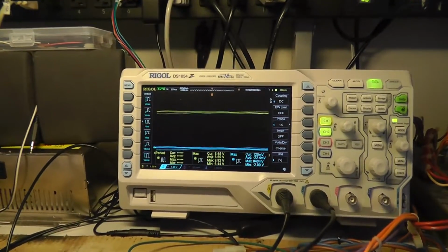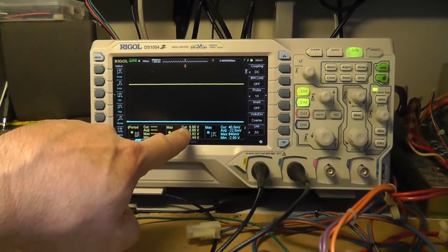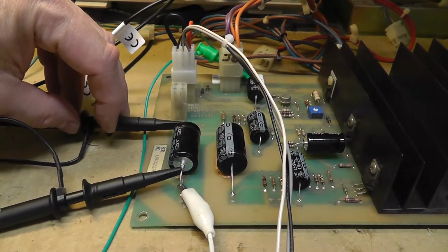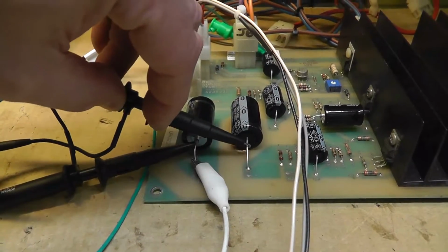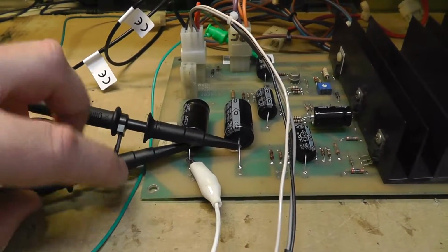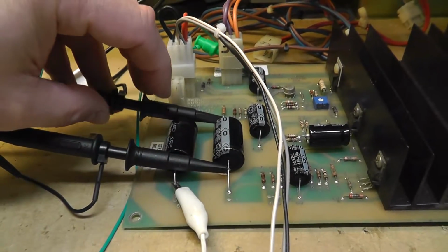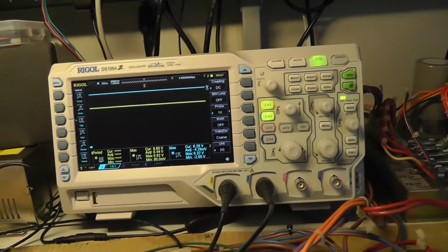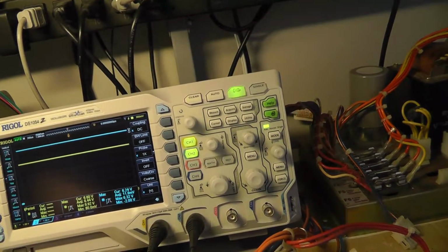So alright, I only have a couple minutes left, but new caps in, and the audio signal influences this a little bit. So if I turn it all the way down, pre-cap we have 6.6 volts coming in, post-cap we got 40 millivolts, and that's on that cap right there. And I did not do the same measurement, so the audio signal definitely matters. Now I gotta switch it around. Hopefully I have some time on this recording with no signal. Let's see here, did I switch it around correctly? Yes.